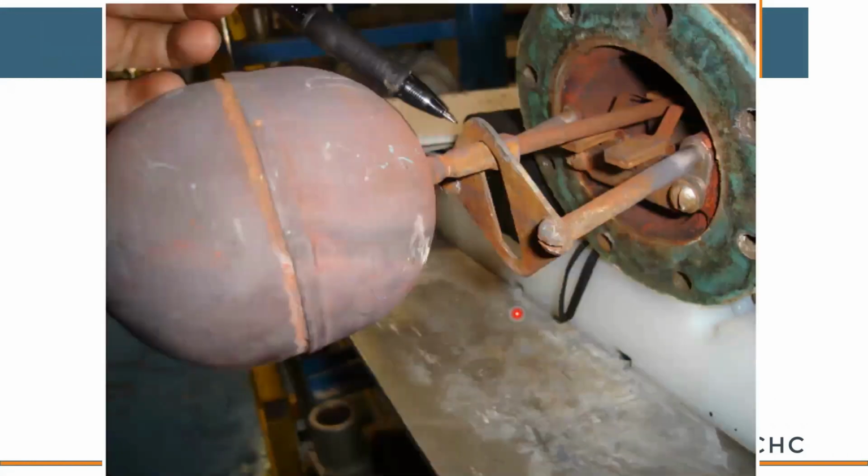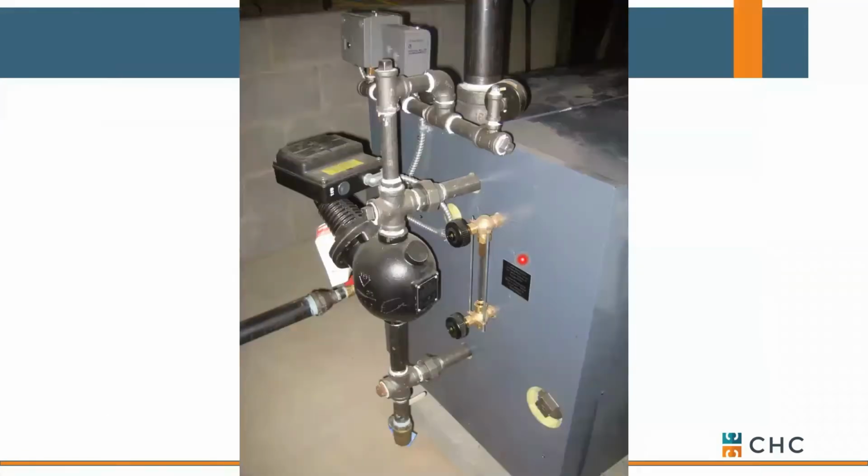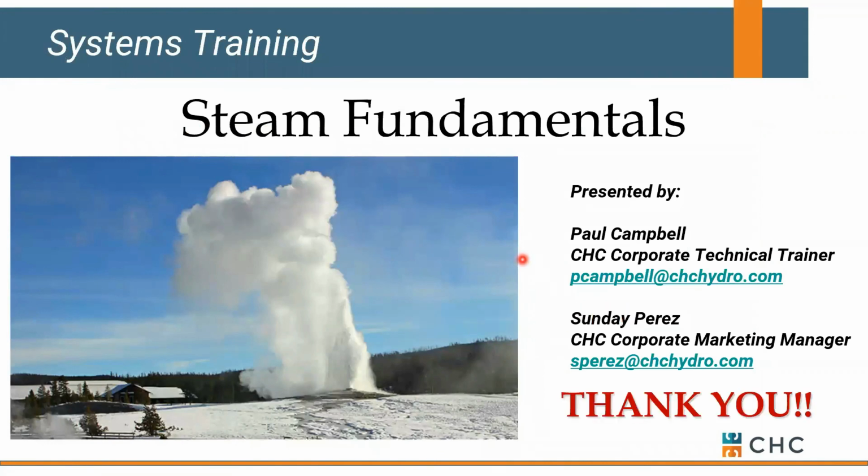Obviously, in this case, the pressure was on production, not on safety. There were also some jumpers on the burner control side. This is just a good example of what can happen when shortcuts are made. And the pressure was on production, not on safety. If you're manually feeding high pressure steam boilers, all bets are off, because if you're not paying attention or you get busy with lunch or Angry Birds, bad things can happen. So that's what can go wrong in a steam system.